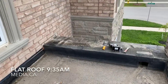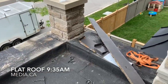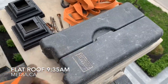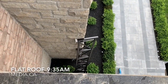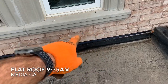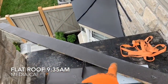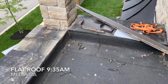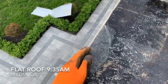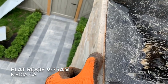Here is an update. I took off the railings, I took off the flashing — all over. It took me maybe 15 minutes for everything. I also took off the exterior wall flashing, which is here. I'm going to definitely be reusing those ones — they're in great shape. The main flashing over here, I was able to remove it, but I decided to go ahead and knock it down completely and do my own flashing. The initial edge for the existing flashing was only covering up this plywood and was sticking at the edge right here. I didn't like that.